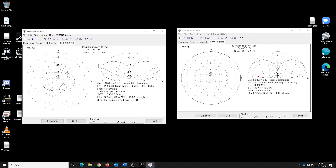Let's think about this - 3 dB, you're hardly going to notice the difference. It's like going from 50 watts to 100. 6 dB you can detect - that is an S point. On SSB there's just a little bit more talk power, going from eight to nine on the volume control. 6 dB you can definitely hear - the voice level comes up, there's more smack to it. Sometimes we look at these dBs and worry a little bit too much. Antenna manufacturers - and I know I'm one, but I'm an odd one out - would advertise this antenna as having 6.1 dBi gain maximum, without telling you that's at 32-33 degrees off the horizon, which is good for about a thousand miles.